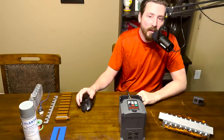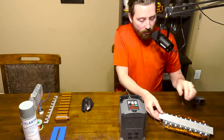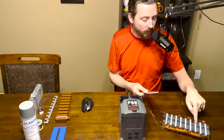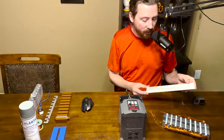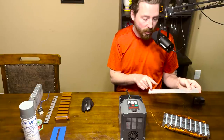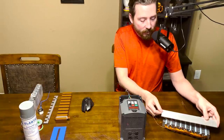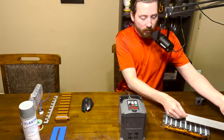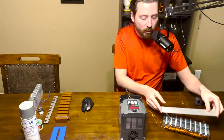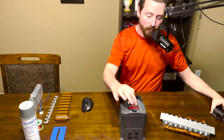Let's run the motor and see what got us to this point. I'm going to flip on the power supply. What we're going to do is create a traveling magnetic field - the magnetic field is going to move along this core section. This piece of aluminum is non-magnetic, but it is a very good conductor. We're going to pass current along it, create a field around it, and that field is going to push off of each individual magnetic field as the magnetic fields travel down the core.